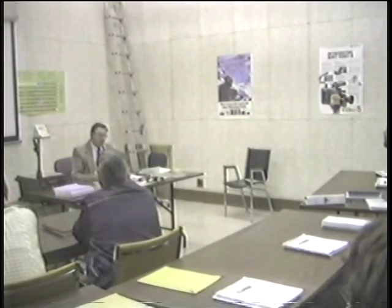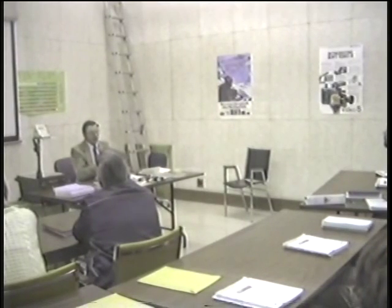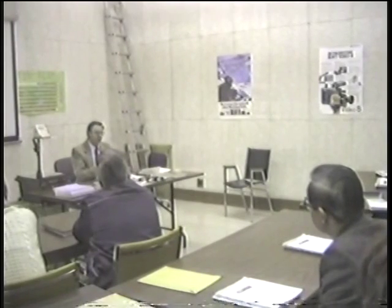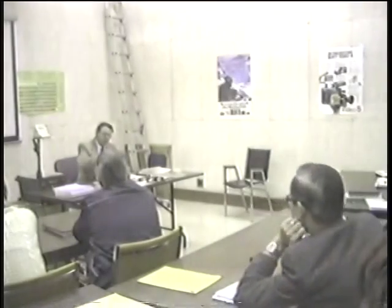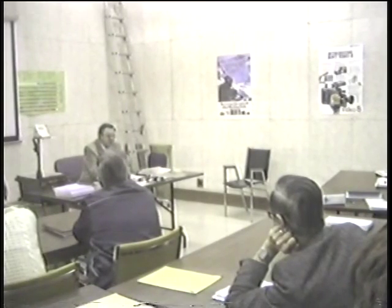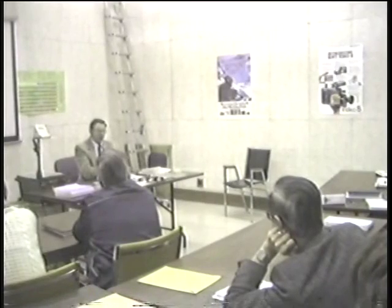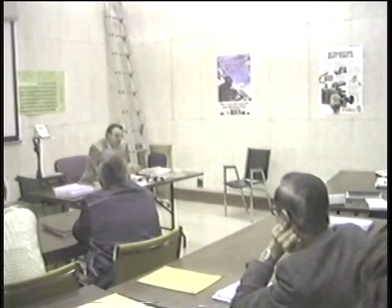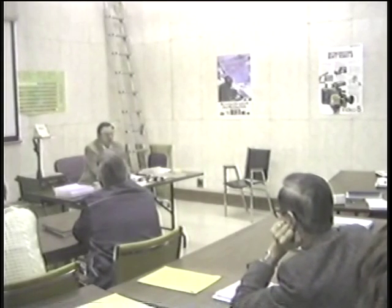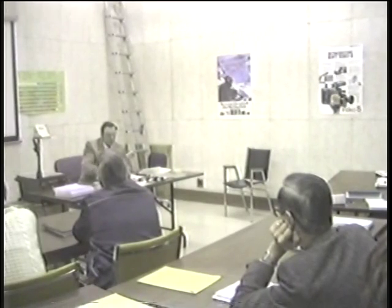What's the big difference in performance? Video-wise, no, but a lot of changes are made in the handling of the signal after demodulation, like for color balance and color presets and all that sort of thing. It's not done with pots and a screwdriver anymore. It's all done digitally through the remote control that the customer uses. But there's no way he can do it, because there's a service switch on the inside of the machine that you've got to take the back off first to switch. The little controller is actually the item with which you program the digital circuitry. You can actually change the geometry of your vertical and horizontal sweep with your remote control. So you sure don't want the guy to get a hold of that.